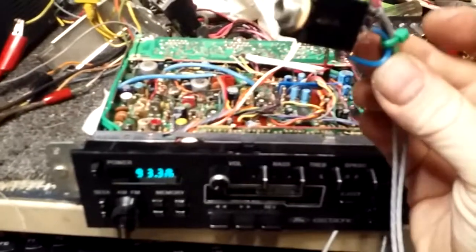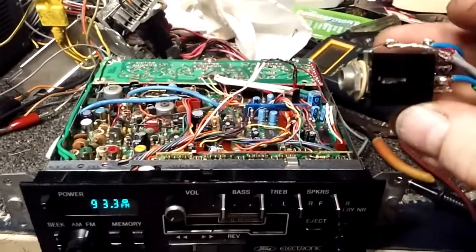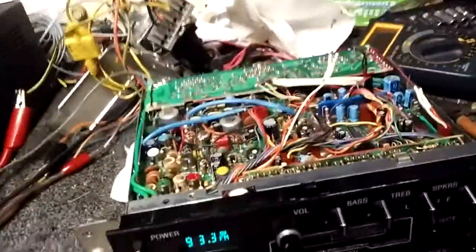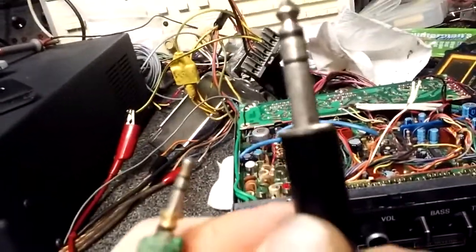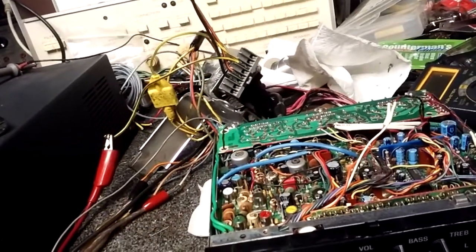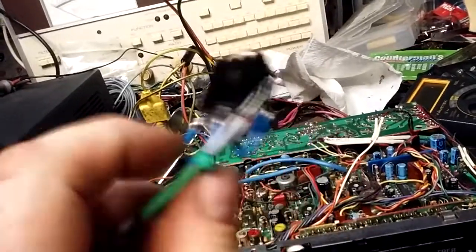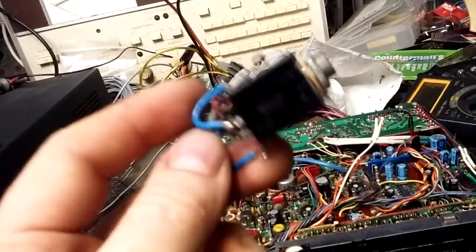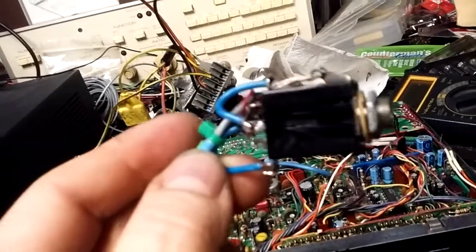At the other end of it, I've got an input jack. This is a quarter-inch jack. I suspect most people aren't going to use this — they're going to use the standard 3.5mm connector, whereas I'm using the quarter-inch. The only reason I'm using this is because that's the jack I had on hand. I'll probably change this, but this was a testing arrangement that fulfilled my needs. What you're going to need is a jack that has a switch in it.